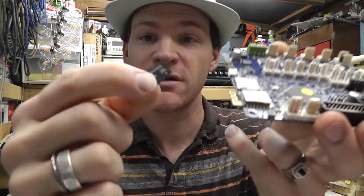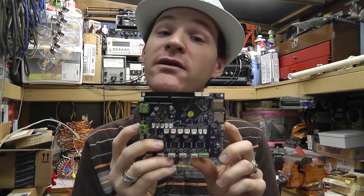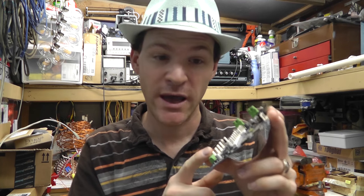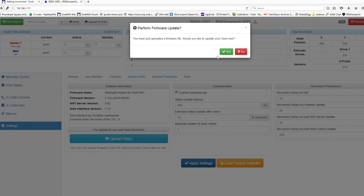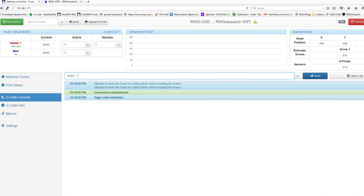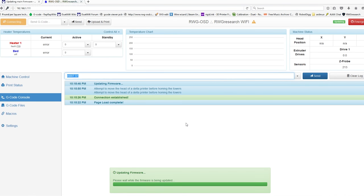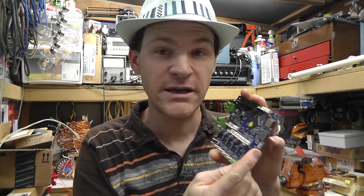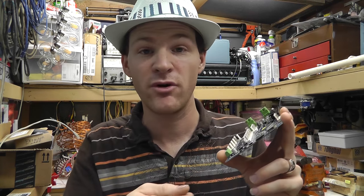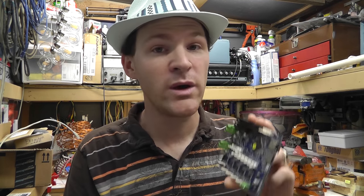This does have a built-in SD card reader, same as the older version. But the really impressive thing for me is how you update firmware. On this version, you just drop the firmware onto the SD card — you can even do it through the web interface — then punch in an M997 command with an S value of 0, 1, 2, or 3, depending on which firmware you want to flash: the web server, the Wi-Fi card, or the main ARM processor. You can do that without ever plugging into it directly over USB. The older version requires plugging in and doing some hard coding through terminal. Now, if you hit the erase button like I did by accident, you've got to go in and program it the hardwired way — which I did, and it worked fine. I'm really impressed about how you update firmware.